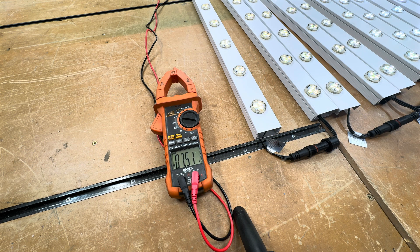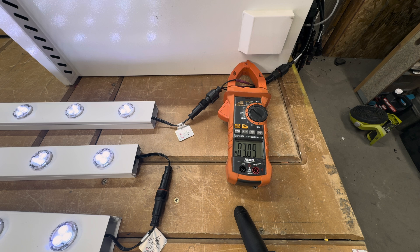Since I'd already laid out 150 puck lights, I decided to go ahead and hook them all up. After running 150 of them, the voltage at the last pixel is 7.5 volts, and you can see on the camera the yellowing of that light — it just doesn't have enough power. The current measurement at 150 lights is 3.07 amps, not much of an increase from the 120-light run.